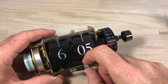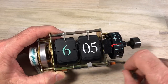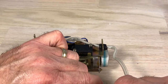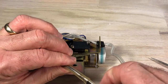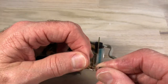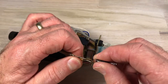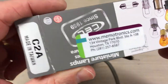To get your bulb out, this is pretty standard — you just move that back a little bit and crimp it. I'm going to give myself some working room here. You've got the outer tube and two inner tubes there. I'm just running a little pick around the tube to try to free it from the bulb — it's gotten stuck over the years. Once I do that I'm able to slide it back without much problem. Now the two tubes — I'm going to need to move them back. What I'm going to try to do is replace the bulb as it stands, moving everything back and soldering in a new bulb this way instead of cutting wires.